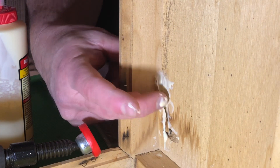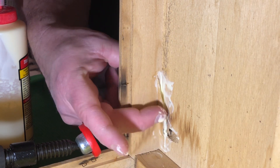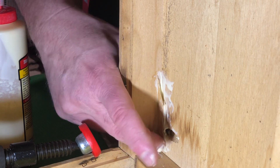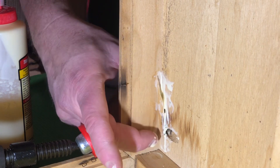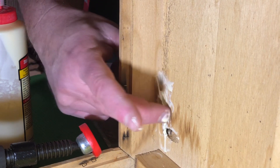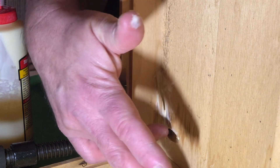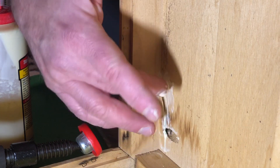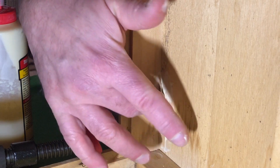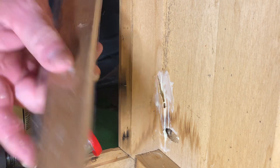The plan is to pump in enough glue — I was too lazy to use one of my syringes. I'm gonna let that seep in; there really wasn't that much material here, just getting it aligned. I think they drove the screw too far, or it was stored somewhere humid and got rained on, and the wood expanded and broke itself.